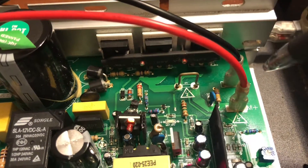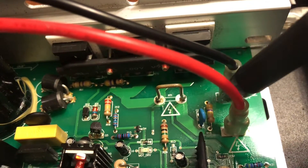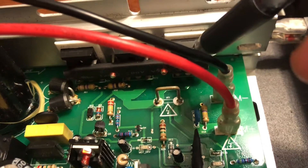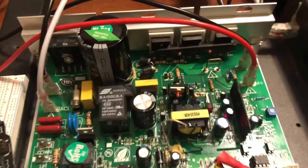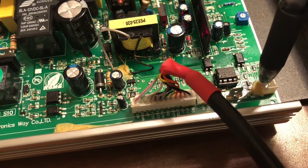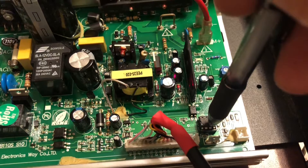These MOSFETs are hooked up in parallel and deliver the main pulsed DC to the motor. This component here is a diode hooked up across the motor, which on decel will take care of the back-EMF from back-driving the main board. Now what's kind of neat is that as far as I can tell, the hall speed sensor only delivers input to the interface board — it's in no way used for feedback to the PIC or the main analog section.